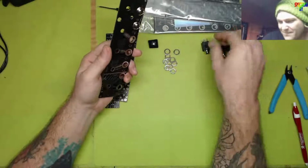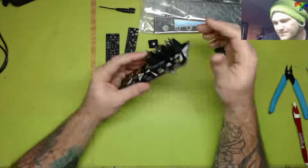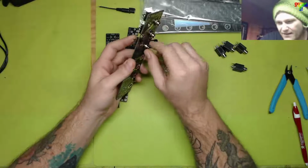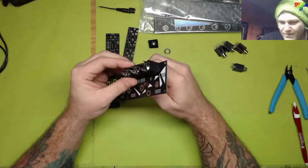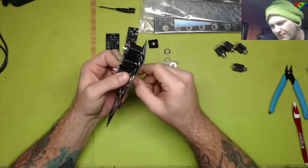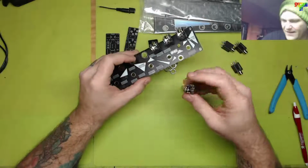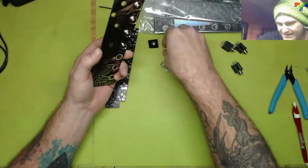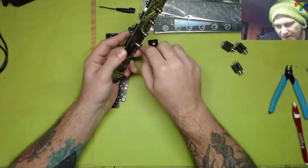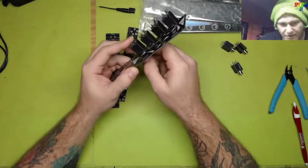It's all right. In order to control more than one oscillator, you'd have to have a potentiometer that basically is like a 5-gang potentiometer, right? I don't know. It starts getting a little bit tedious to think about that sort of thing. So I was trying to think of something that may not be the most efficient way, and it may not be the only way, but it's the way that my brain decided to go with it. Take an Arduino, and it's a 5319 or something. I'll have to go look at it again. But it's a digital potentiometer, right?